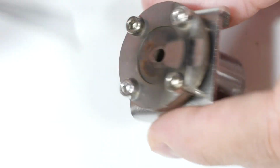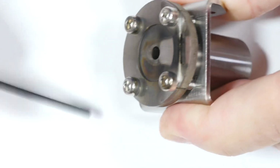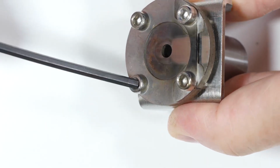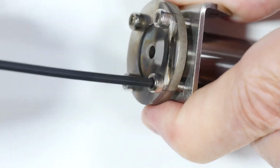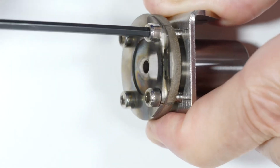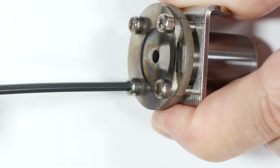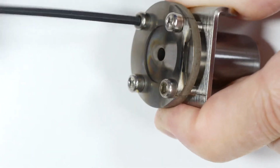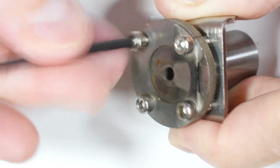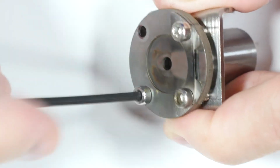and start unscrewing stuff. When I got this originally, I checked the tightness, and this one screw down here was loose, which is not a good sign, because usually when you tighten a cylinder head, you cross tighten things, and it means somebody wasn't cross tightening it. So yeah, that screw was not tight either. Okay, and these are all stainless, so the materials are really just first rate.